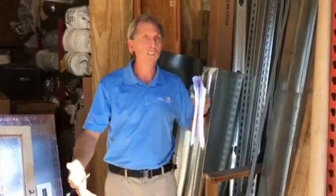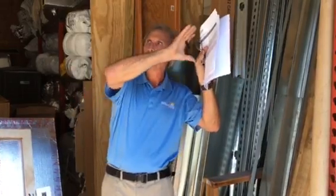We've done a lot of linear diffuser jobs and I've had calls from people wanting help figuring out sizing and CFMs per foot. The rule of thumb is one CFM per square foot, 50 CFMs per linear foot. We run a trunk line and feed everything out with five- and six-inch flexes to keep things quiet and neat. If you have any questions, go to our website at jonesaircondition.com. If you liked this, please share, subscribe, and comment — thank you.